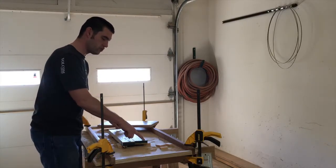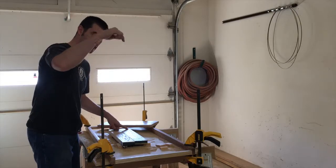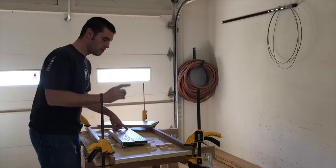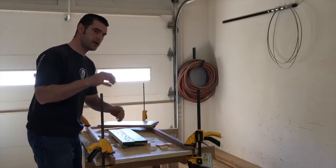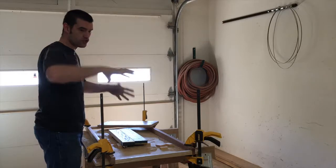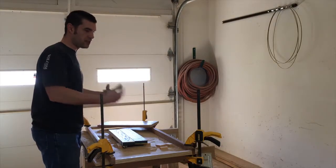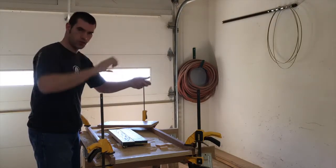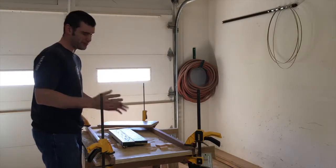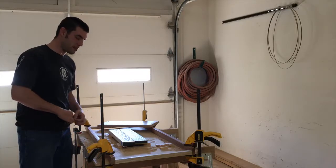And then also, when you use the screws, set the outside diameter hole for the head of the screw to go down in, deep enough to where you won't hit the screw head with the router bit, but it doesn't have to clamp down on the wood. You don't want it to clamp down, because then you can basically stretch it into a flat shape or an out of skew shape, and then when you mill it and you take it off, it still won't be flat because you have actually twisted it to where you wanted it to be based on the force of the screws, not based on the natural state of the wood, if that makes any sense. If not, leave a comment in the video and I'll explain it better.